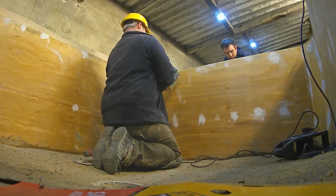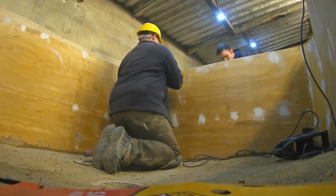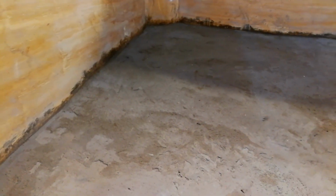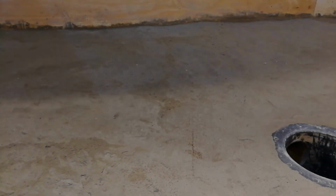I then brushed out the bases to clear away any loose sand from the render, and finally the insides of the bottom drains were roughed up with sandpaper to make sure that the fibreglass would key to them properly. Everything was ready in the nick of time. Stuart was coming the very next day to get started.